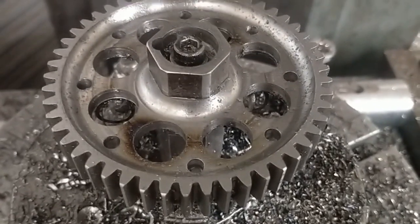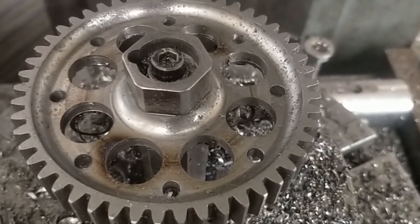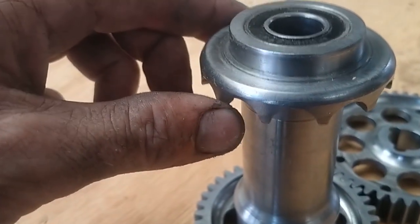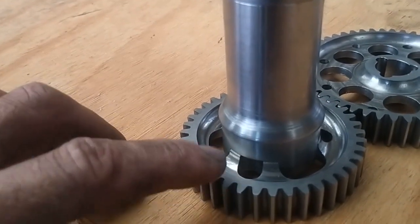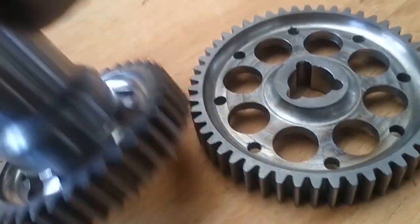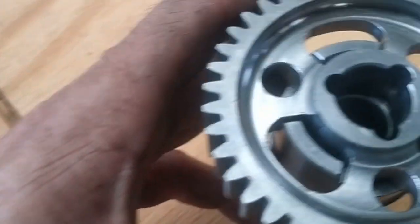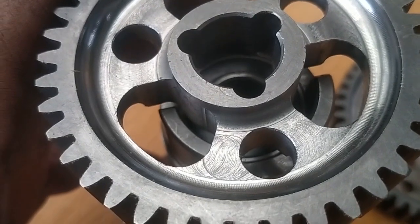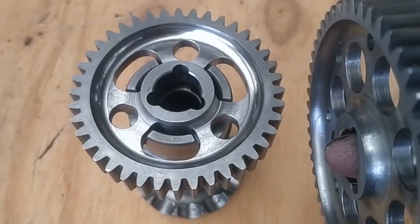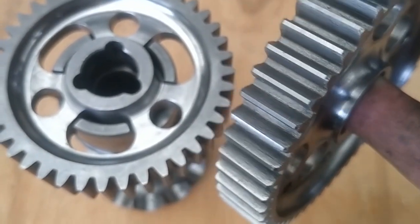And that completes the project. I will do the same to the other gears with the dicky tooth before we send them off to heat treat. This is what it looks like when it's all cleaned up. We've got the crown gear here which will take off to the tail shaft. We've got a dog clutch which lets this slip off the dog clutch and engage with the winch drum gear. The keyways in here also let the input shaft drive the crown gear. But when you slide it up here it's no longer engaged with the crown gear but is engaged with the winch drum gear. We'll see you next time.